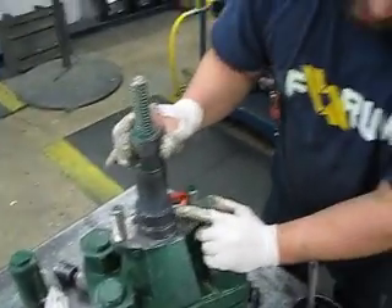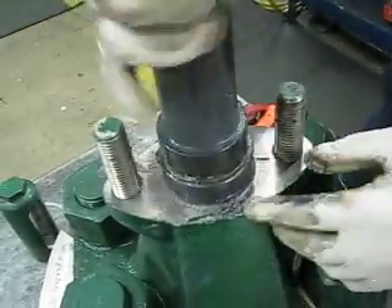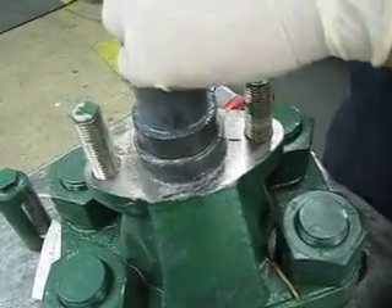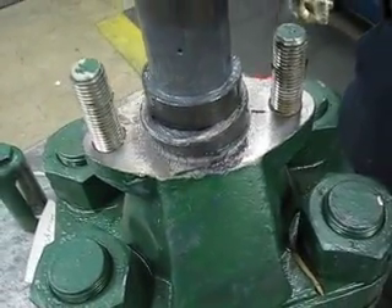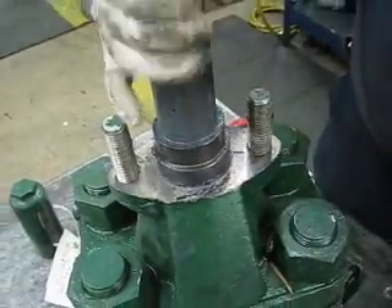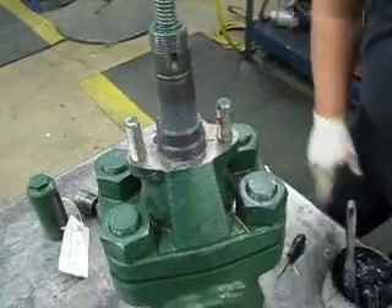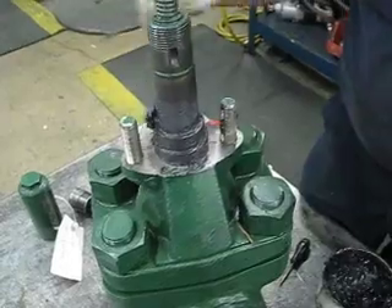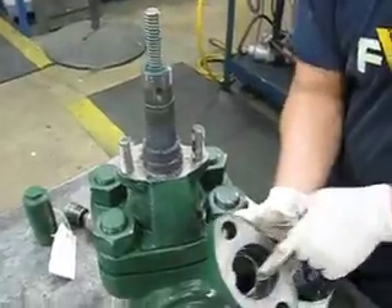Make sure that when you go all the way down on this, your bearing is actually lined up even with your stem screw. You want to have your bearing centered right underneath your stem screw — you don't want to pinch it. It's pretty centered there. Grease it back up. Now you're going to install your screw housing. Make sure that your bearing is in there.